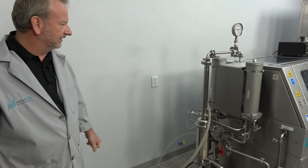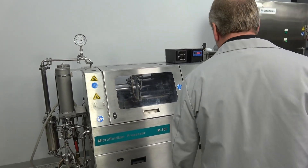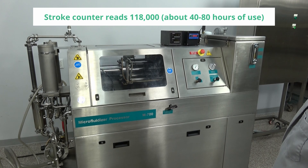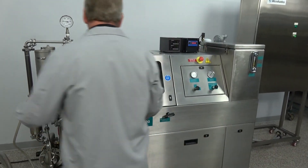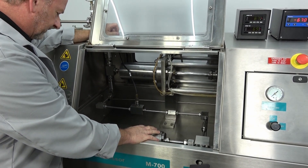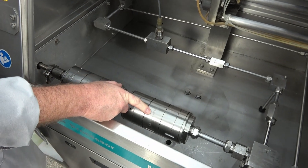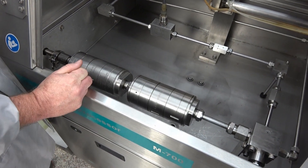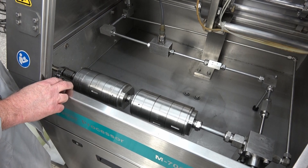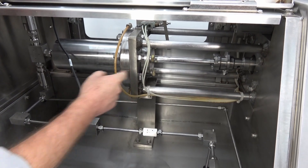Very nice machine. It has very little use for the age of it — the stroke counter was at about 11,000, so very low use. We're going to go inside and take a look. Here you can see your main interaction chamber, which is a Diamond F12Y-5 — that means it has five channels and is rated at 40,000 PSI. The auxiliary is the T60Z, which is very common for an auxiliary module. You have your hydraulic cylinder back here pushing your pump cylinder, creating the high pressures in the pump head.